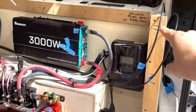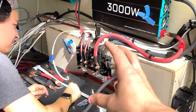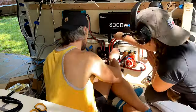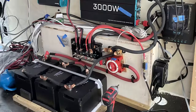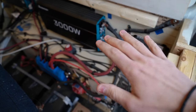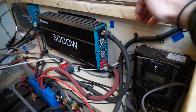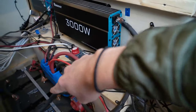This area is for our solar — it's going to come down into this and feed into here to charge our batteries. What we have hooked up here is our bus bar, which is basically our brain. Phal is finishing up port three. We'll give further explanation of fuse sizes and ratings in a future video. This is the system completely done. Don't get overwhelmed — we're going to link our diagram for the entire electrical system. Focusing on the solar portion: our MPPT charge controller is taking all the power being produced through the solar, harnessing it, passing it through to our bus bar, which then charges our batteries.